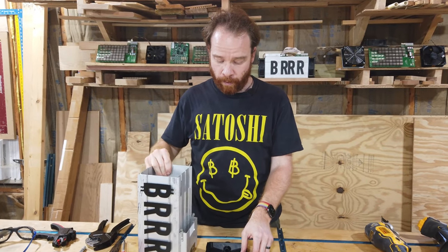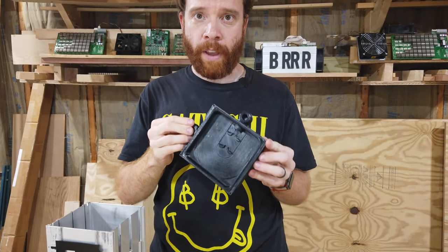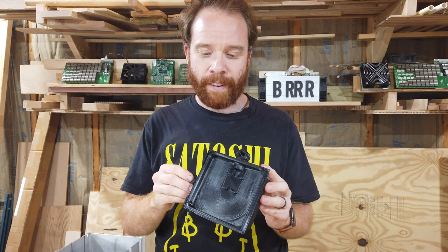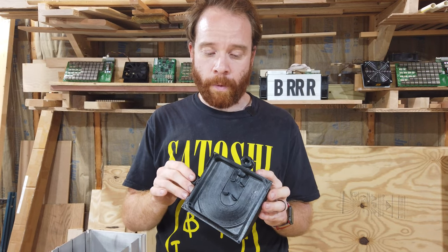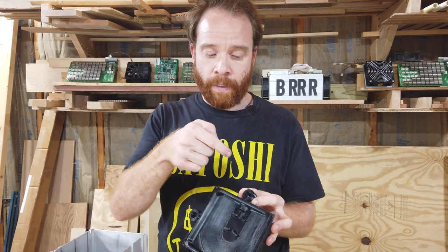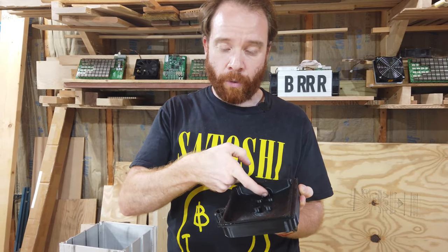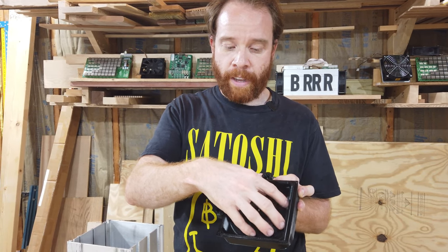In order to do this, we have a so-called injector plate. This is 3D printed with ABS. It is a design by Adrian. Thanks a lot for that. You can find the designs for them all online on our GitHub. Basically, the injector plates have two holes. One of them is for the inlet, so the oil gets pushed through here and comes out through this hole, through this little tunnel, and gets dispersed in here.